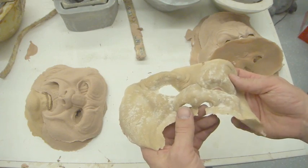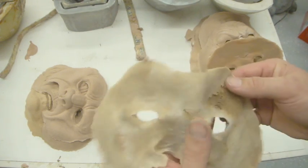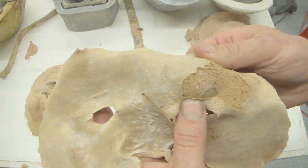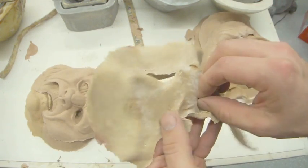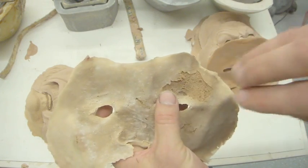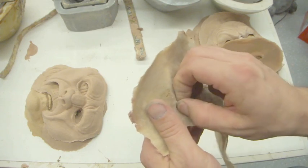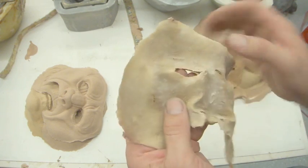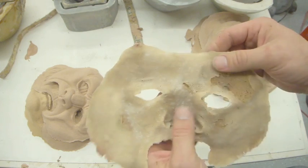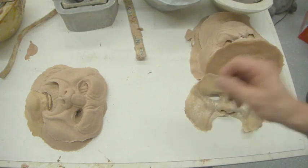Okay, this fella's a beast from Beauty and the Beast. It tore getting it out, but if you turn it over, this is called spider egg, and it's pretty nasty. It's like a total surface failure. You can get way worse than that, where it just looks horrible. But it's a total structural failure of the foam. What causes this is if you bake your foam before it's gelled, it does really nasty things to it.